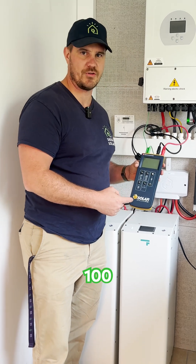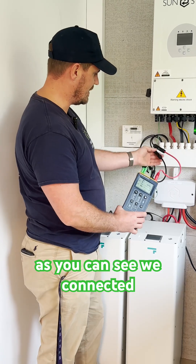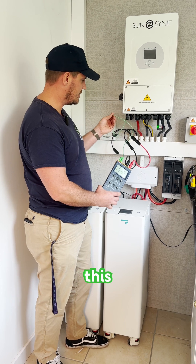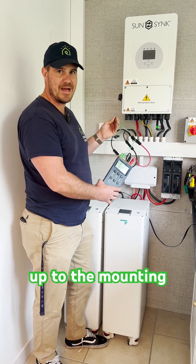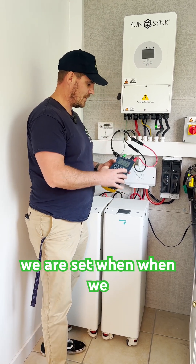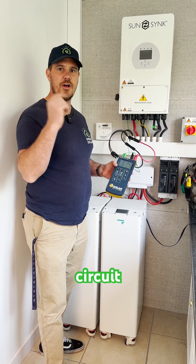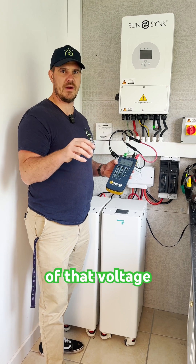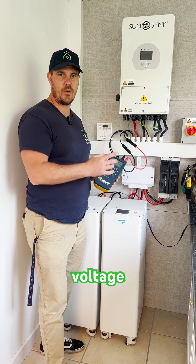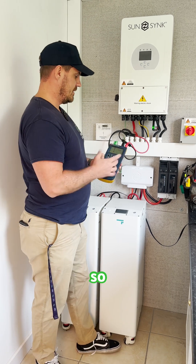The way we prefer, which is the easiest, is we use a Seaward PV 100 - this is an older model; they do a PV 150 and PV 200 now. We've connected positive and negative to our panels, and we're connected using a reference point which clips onto the framework of the panel mounting. When we press the button, we're sending 500 volts or 1000 volts around the circuit and looking for any voltage that's escaping to the mounting, which gives us an insulation resistance result.